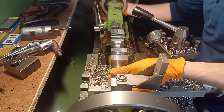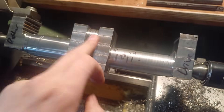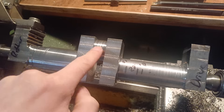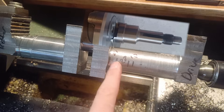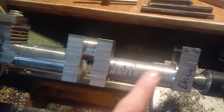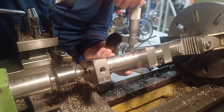Now swap it back to the other centres. Quick update on the crank — I've moved back to machining the mains. I've done as much as I can do on the big end with the tools I had, and I'm pretty happy with it. As you can see there are a few imperfections where the high speed steel was chattering, so I've left extra meat on there for when I've got the proper tooling. Now moving back onto the mains — there are a few different steps where it gets thinner and thinner towards the end. I do want to quickly check if I'm turning a taper, because when I was making the valve guides it was tapering, and we can't have that on the crankshaft.